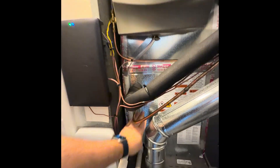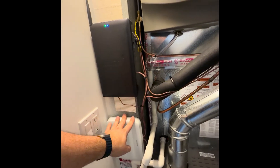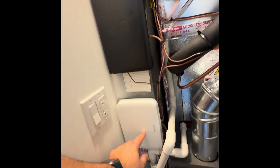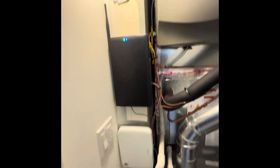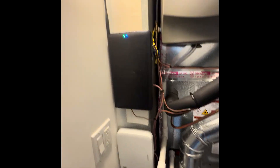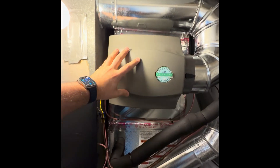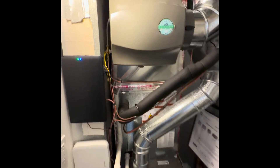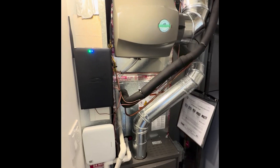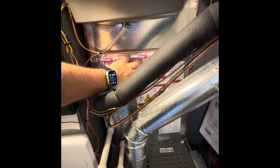We installed a new coil to match the outdoor unit. The key of this system that makes it feasible to install in most buildings is what Samsung developed — the Samsung Hub — which only needs two wires to go outside, and all the wiring needed is done internally. We also added a humidification system that's automatically controlled by our Lennox thermostat. The thermostat has the ability to program when we want to heat with the furnace and when we want to heat with the heat pump.